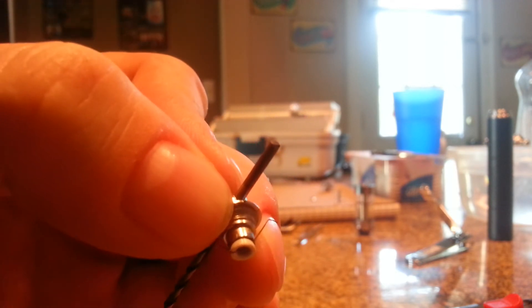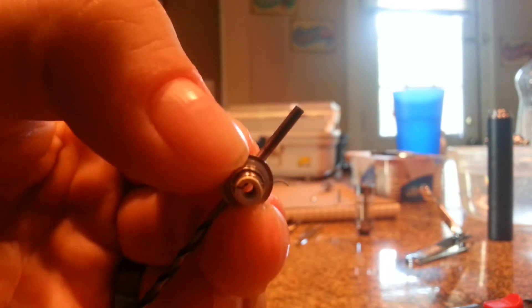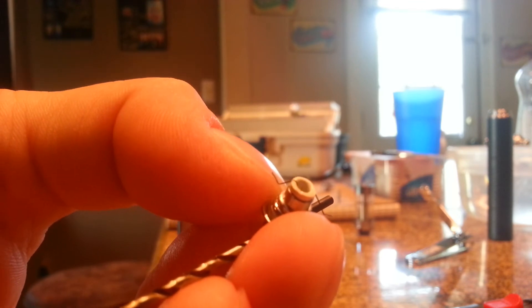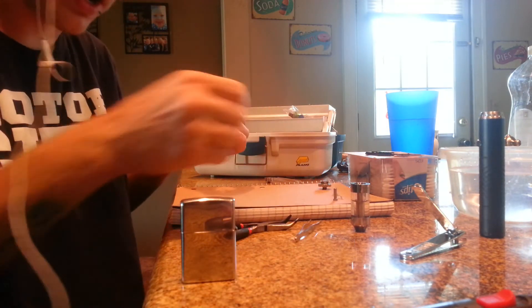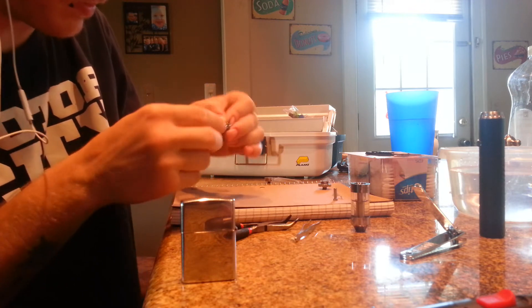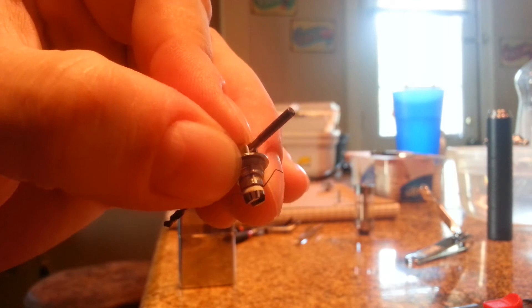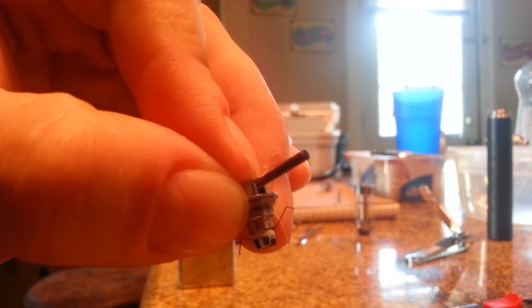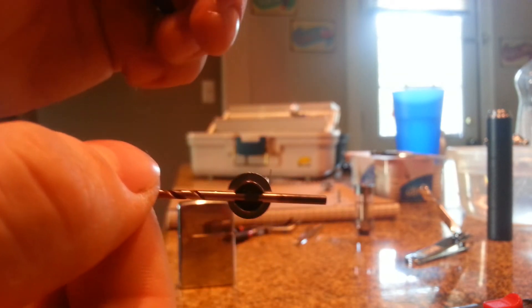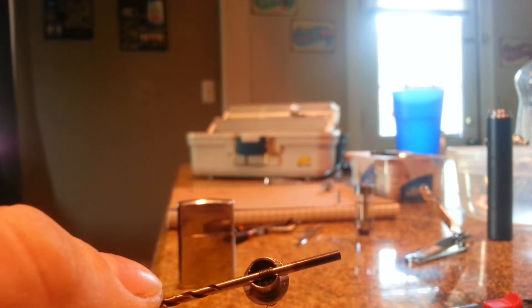It's the left one. You can see how it's through the center of the insulator. The first one was the one that's not through the insulator — it's just pulled over the side on the base of the coil head. Then you got the center one through the insulator, pulled over the other way. That's how you do that. Now you take your center firing pin and you stick it in there. Here's your center firing pin through the center of the insulator. You can let go of that because it's got the drill bit on there. Looks nice and good — all the coils are nice and snug and touching each other.